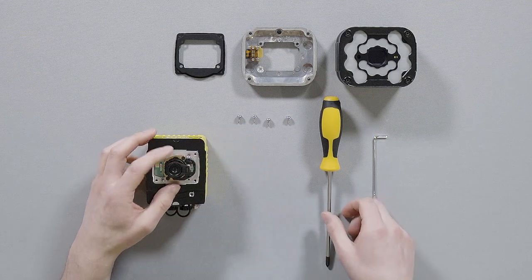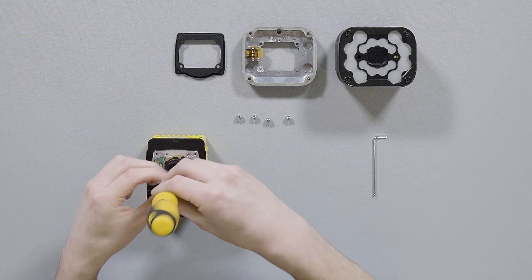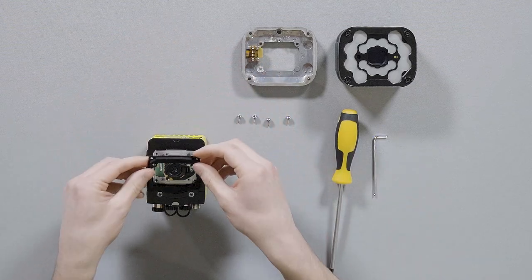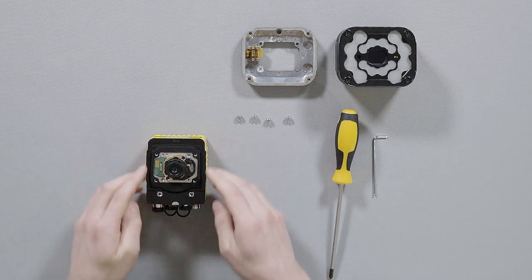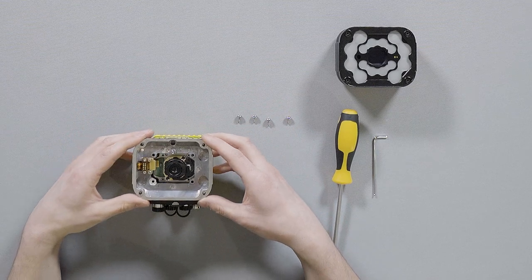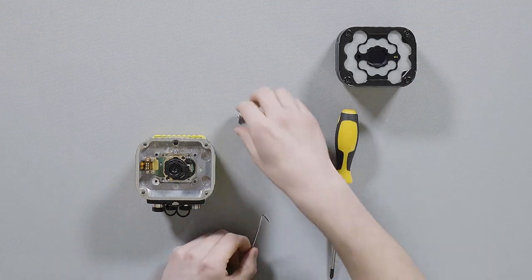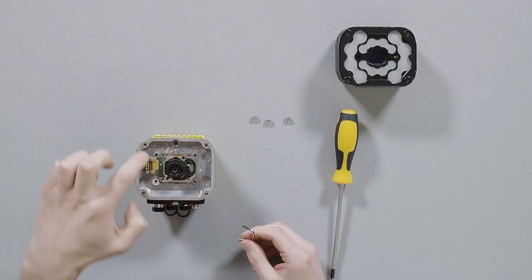Make sure that the connector mates with those pins — you should feel a little bit of resistance. Once that's in, screw in the lens itself, starting from the bottom and working your way up. Next, put on the rubber gasket which will seal the light to the body of the camera, making sure the holes are lined up. Then put on the mounting plate for the light module, lining up the four holes and the pins on the left-hand side. Install four more screws in the cross pattern marked on the device.